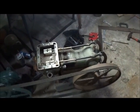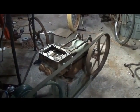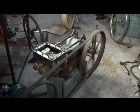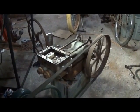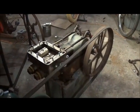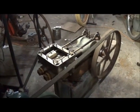My belt's on there — it's not on there great but it's on there. I had tightened this one down on the drill press, but that one there is heavy enough it's pretty much self-locating. With the linkage basically done, I'm still going to drill the holes in the eccentric for the oil, do some adjusting on the valves, and make sure they're seated right. I think it's going to work out fine.